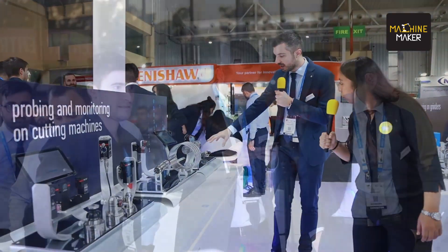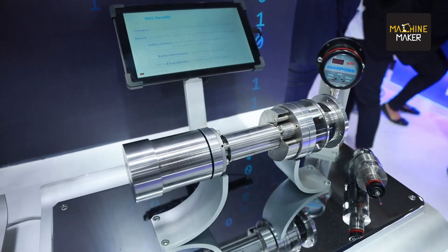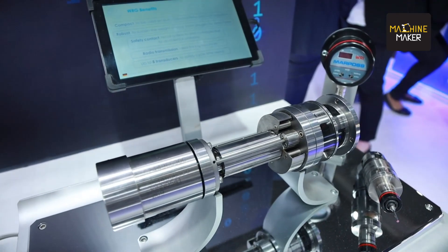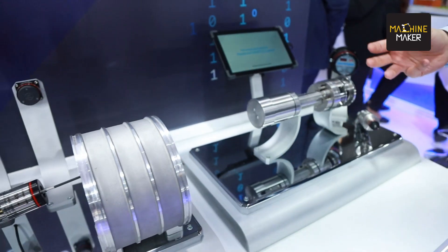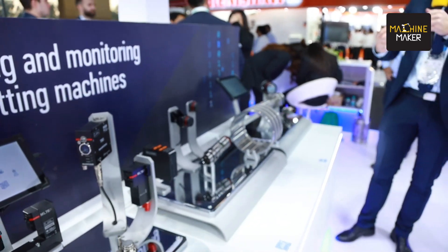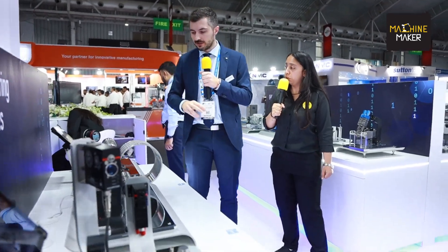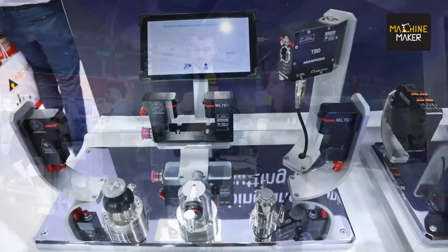In this display, we have the WRG — a system used to measure with incredible accuracy each kind of bore, mainly for cylinder bores, connecting rods, and other applications mainly related to the IC motor, but also in other conditions where there are always strict tolerances.